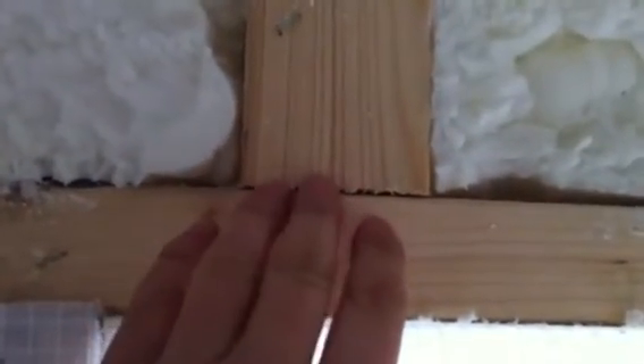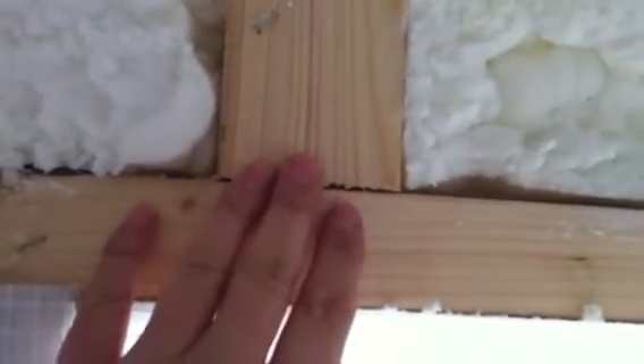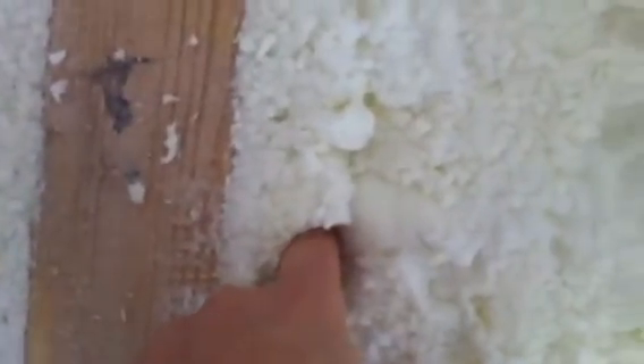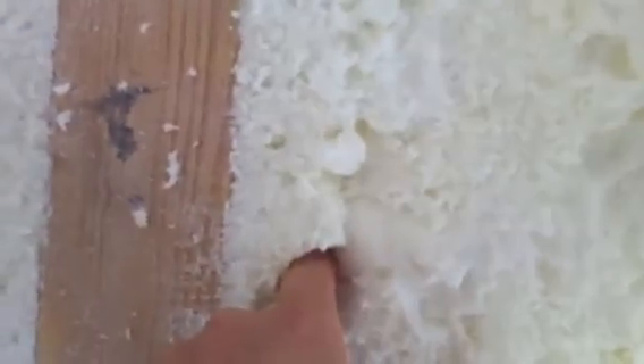Remember that the foam is behind this, uninterrupted by stud work, so we're hoping that the combination effect of that lump of foam means that wall is basically airtight. Even where you see little surface anomalies like this, it goes back to solid foam and finally meets the wall. There's that slight curling again, but it does appear — if I look in — that it seals to the back of the wood, and elsewhere it's tight to the wood.